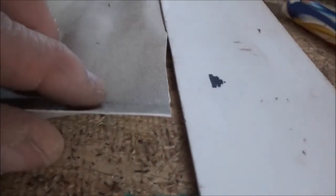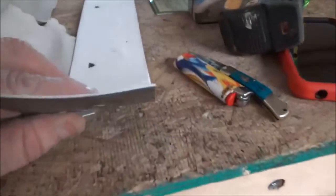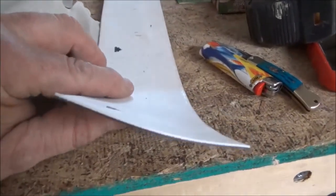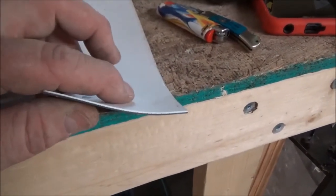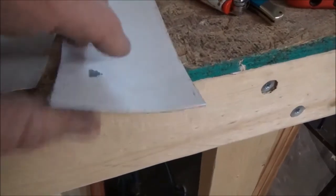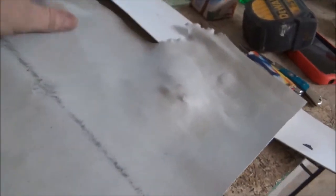It looks like the vinyl that you put on your truck — vinyl wraps. This is 60 mil right here — big difference. And this piece, like I was saying, this piece isn't even as thick as the top layer of this TPO here. It's about half of that, so it's probably about an 18 mil or so. Super thin. But that's what the RV industry does — they just put it on as cheap as they can, get them sold as high as they can.